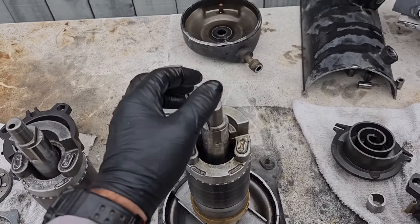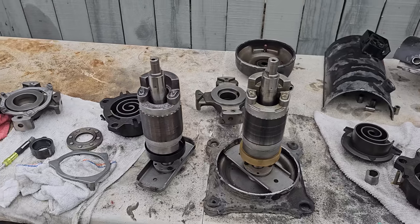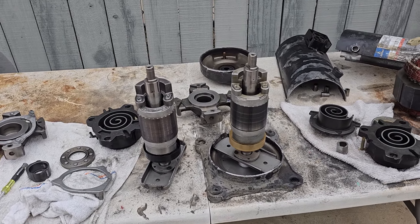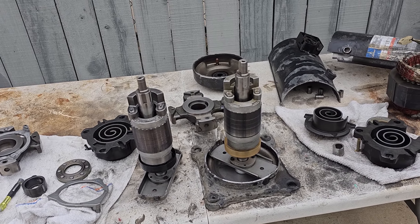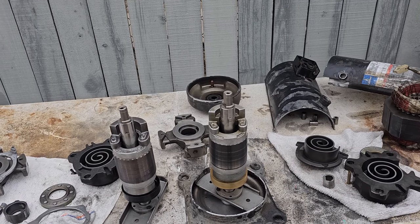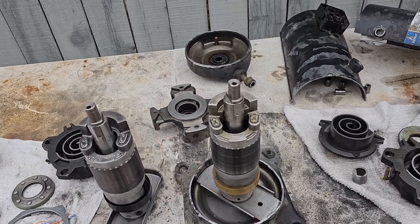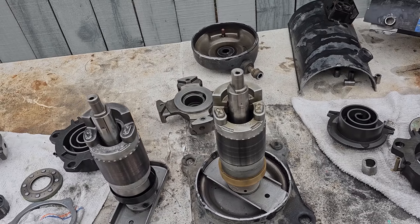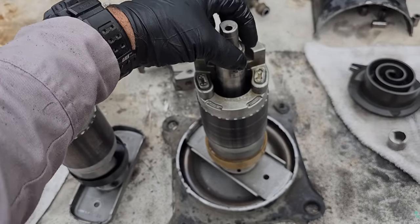I don't know if I'll get it on film, but we're going back to check the evaporators. What I was getting at a minute ago is I originally thought our issue was going to end up being that they have two evaporators that each have their own power switches and they're constantly turning them off, but it doesn't turn the temperature controller off. So it frosts up the coils. I guess that could still be part of the cause, because if we have low superheat coming back, it's going to cause issues with lubrication. So I guess it's still possibly what could be going on. But it wasn't really a lack of oil.